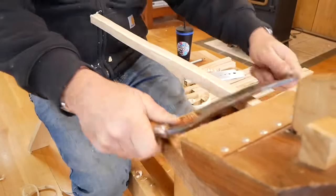Turn it back when you put your spindles together. Here you see me putting that stretcher bar between the two rear legs — this design only needs the stretcher bar in the back. There won't be any other stretcher bars on this chair between any of the other legs. Lots of dry fitting — that's why it's important to mark where your legs go in the grain direction. Always taking it apart and putting it back together. And here we're marking the slots that are going to take the wedges — the spindles go all the way through the chair and then get wedges through those slots.